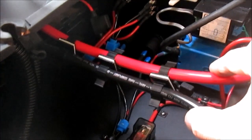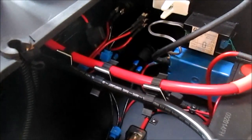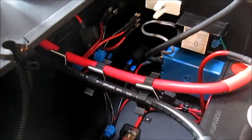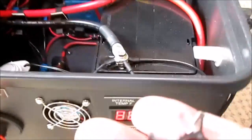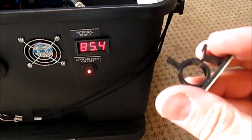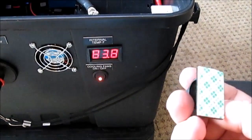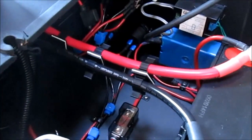One of the things I've done to improve the safety of this system is take care of some cable management. These two large two-gauge diameter jumpers between the batteries were initially crossed over. I'd recommend you simply buy or make shorter lengths, but if they run a little long, keep them separated — don't cross them over in the interest of safety. I've purchased six cable connection clamps — plastic clamps with adhesive backing that pair up to keep those cables separate and prevent any possibility of a short.